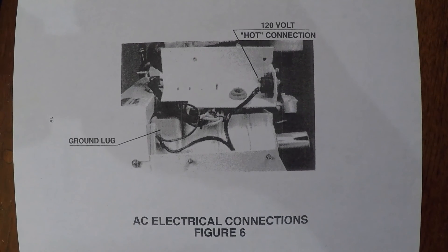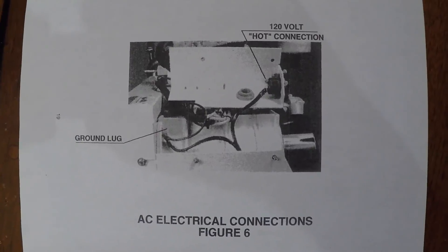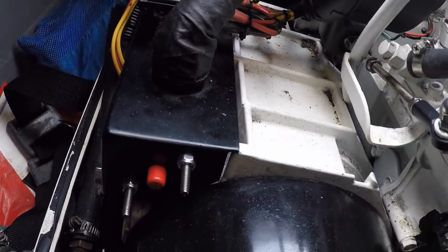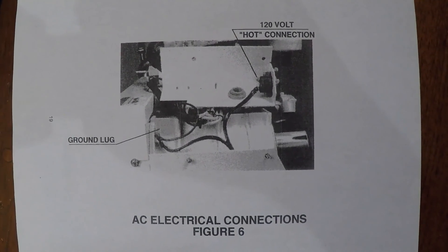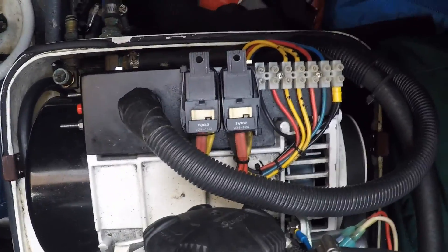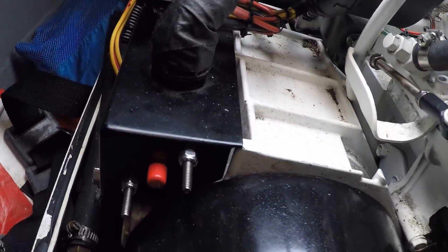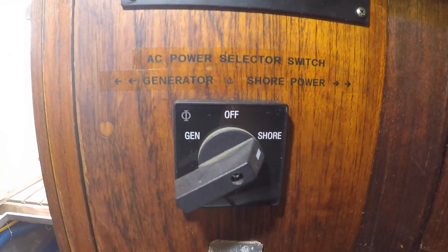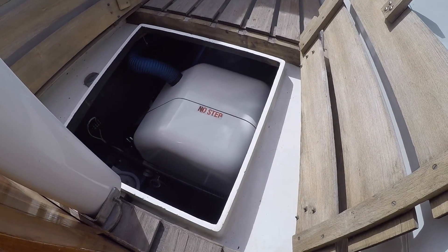Let's look at the hookup that runs my 110-volt pump. Simply put, the pump plugs directly into the generator's electrical box using its unused 50-amp breaker stud for the black, while the other two both go to the ground stud at the other end of the box. That's it — no on-off switch, no panel breaker, and no long wire runs. When the engine starts, electricity goes directly to the pump and it's not dependent on the main switch. The pump runs whenever the engine runs, and it also stops when any of the safety sensors shut down the engine. That's a pretty bulletproof setup.